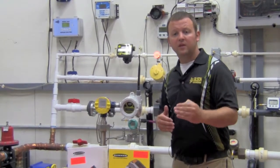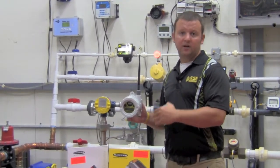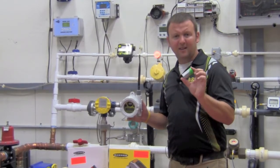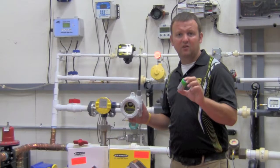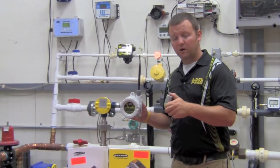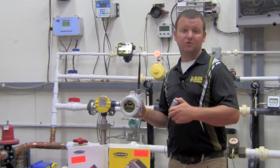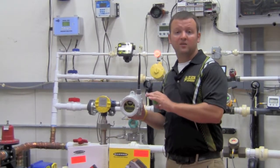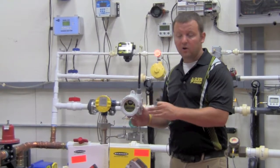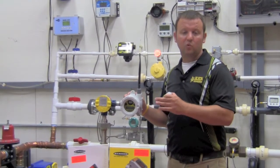With battery management, the lower my pull frequency, the longer my battery life. I can update at once every 5 seconds or once every 4 hours — it's up to you. The 19 amp-hour battery is a commonly available, very low cost battery you can find online. Whereas if you're familiar with WirelessHART, those batteries can get pretty expensive — we're talking in the couple-hundred-dollar range per battery. So it's quite a cost savings over some of the other technologies, plus you do get that 900 megahertz, which eliminates or mitigates much of the issues of the 2.4 gigahertz WirelessHART frequency.